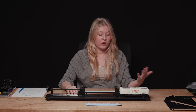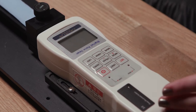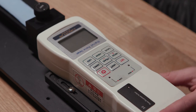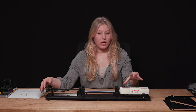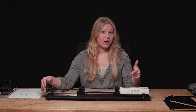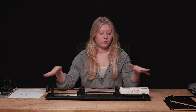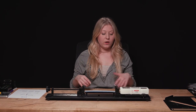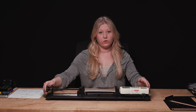Now turn on the digital force gauge and start moving the ruler to record measurements. The only button you need is the power button — do not press any other buttons during the stretch test. Turn it on when you begin and off when you finish. The gauge may jump around; be patient and wait for it to stabilize. Movement on the table can affect it. If it doesn't fully stabilize, pick a number in the range you see it moving and that will be sufficient.